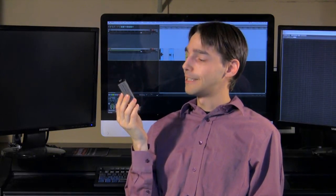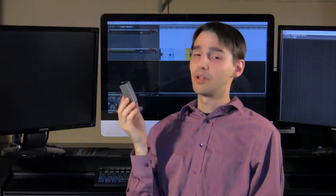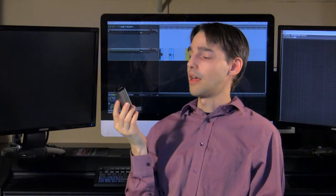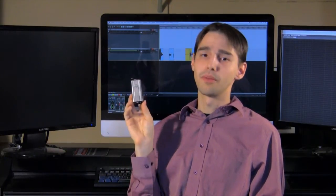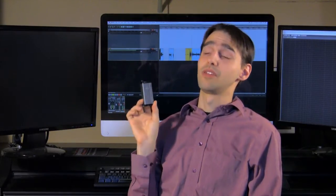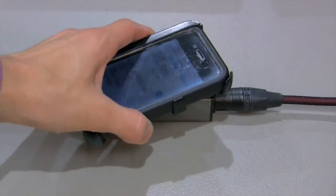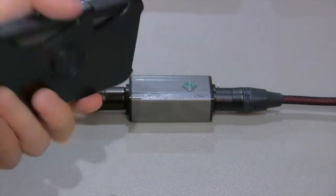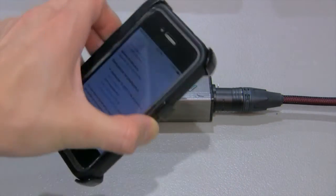As far as noise goes, it didn't help out in the studio, but I did get a little bit better noise performance when I plugged it into the Tascam DR40, because that has super super noisy mic preamps, so this was able to help out just a little bit. It's really susceptible to GSM noise — cell phone noise. I was like eight feet away and I started noticing it. I'm not sure if it's because they just didn't shield the internal components very well.